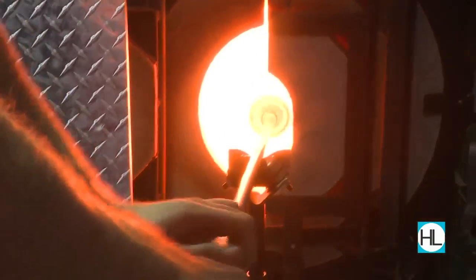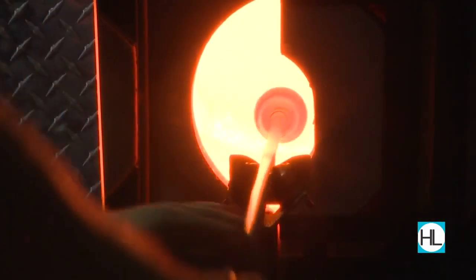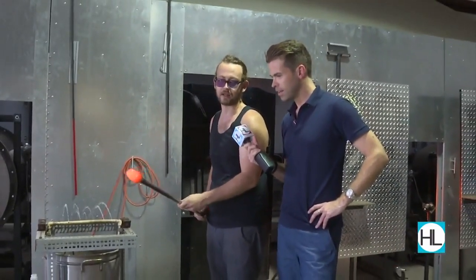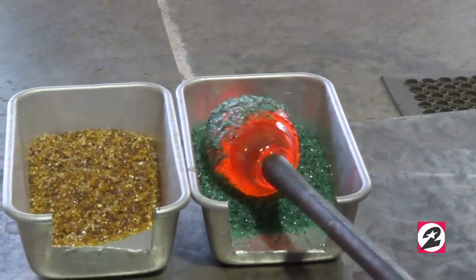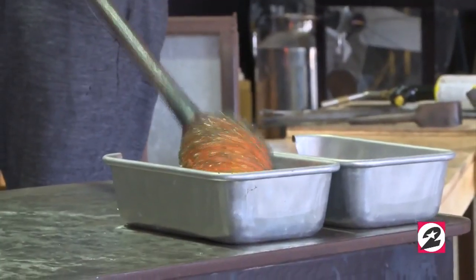Whoa. We'll let the excess trail off inside. Then one puff and a cap will trap air inside, letting it heat up and expand — and that will blow our bubble. So all these little chips of metal oxides are added to them; it's like rolling a donut in powdered sugar. From here we'll go back in and melt all this glass in.